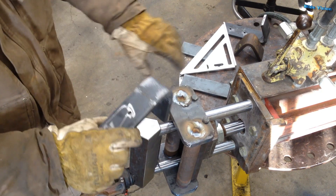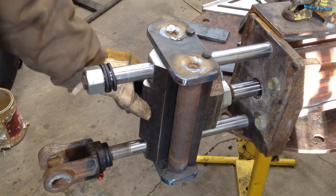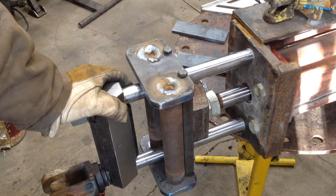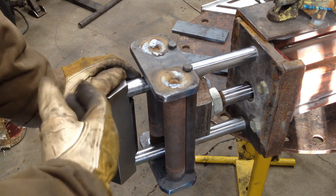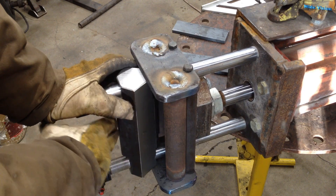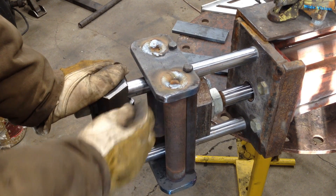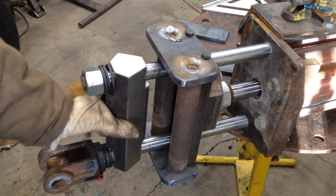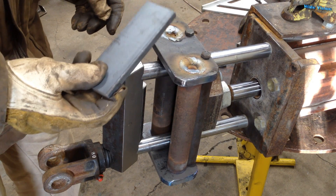Wow, that was fast and easy! Normally this thing sliding down and vibrating down the rods won't be a problem because the press will actually be sitting more like this, so the weight of it will make it vibrate down to this end. If it does become a problem and wants to work its way back, I can just put a little set screw in here somewhere — a little allen key to give a little friction against the shaft, not really lock it down hard, just enough to keep it from sliding.